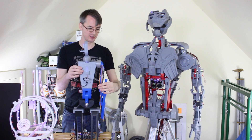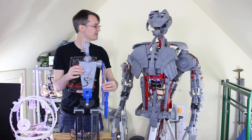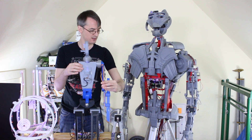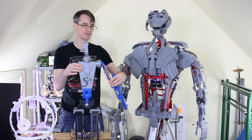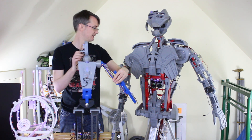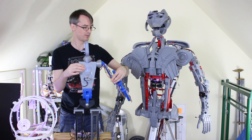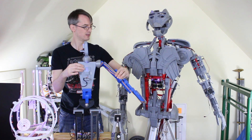It's much easier than waving a mannequin head in the air. That works pretty well. Then we've got the axis on the upper arm — if I rotate it, Ultron's shoulders rotate. If I go forwards and backwards, the arm tries to stay facing forwards all the time. There's also the linear actuator that lifts the arm out — it's scaled down a lot because it's a very powerful actuator — but I can raise that up. The other arm is disabled at the moment instead of mirroring. As I move the arm forward and twist it, all the other joints respond.